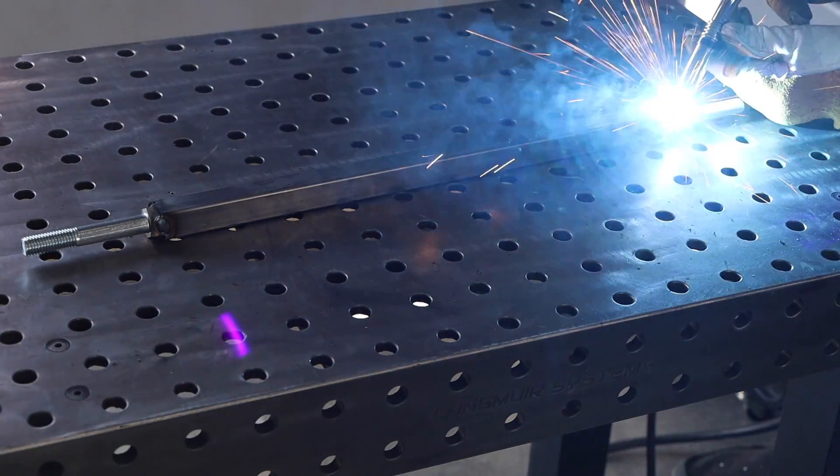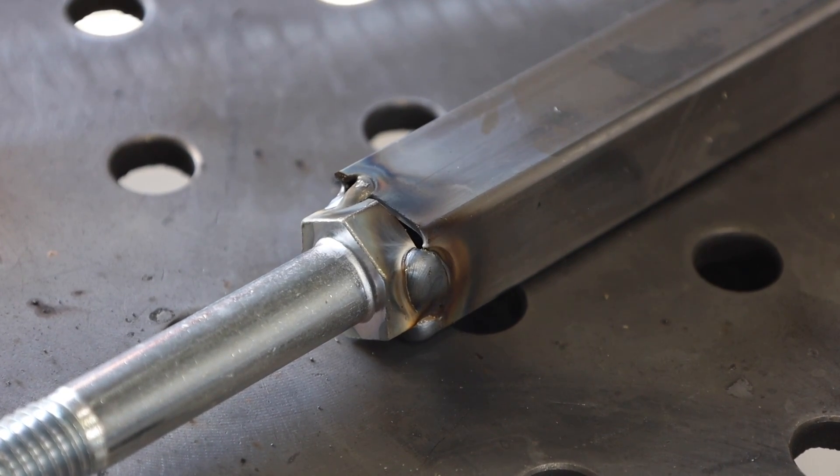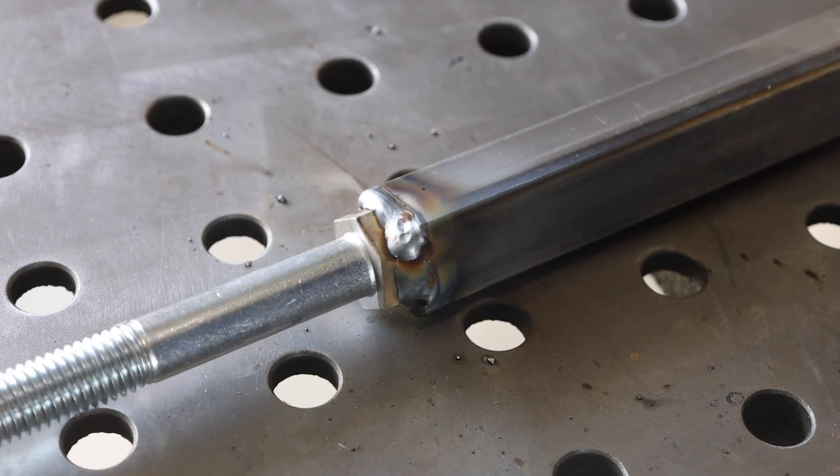The key is changing that position a little bit towards the thicker material to focus the heat there, while keeping the settings high enough to actually penetrate and fuse with the thicker material. On the rear axle, I have a bolt to put in — a little bit of a challenge because there's a gap to fill. But it's a good demonstration: I'm just welding on my thicker material, building it up until it melts the thin material easily, then it fills in as smooth as you can have when welding thick to thin with a gap.